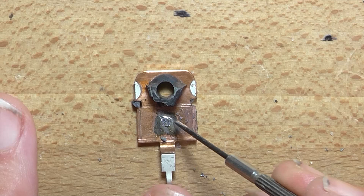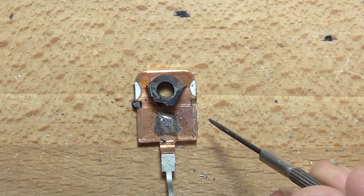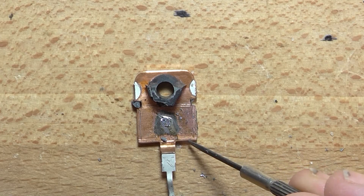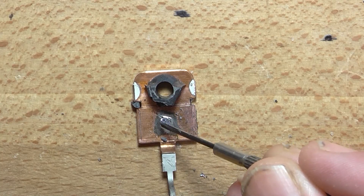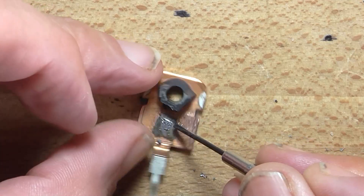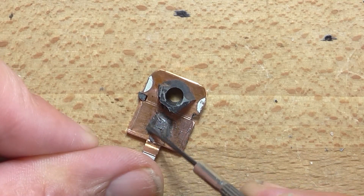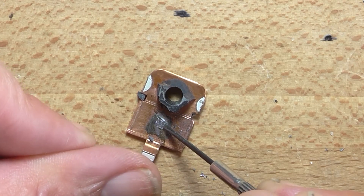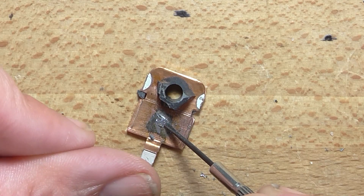This burnt section in here is actually the die of the transistor. There's supposed to be a bonding wire going this way off to the emitter leg — that's the collector — and there should be a bond wire coming off here to the base connection. But this little blob, excluding all these burnt bits around the other side, this little blob in here, which looks awfully like a surface mount device — that's the die itself.